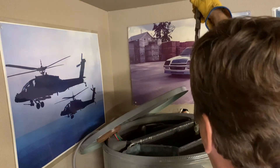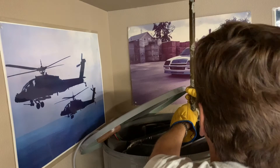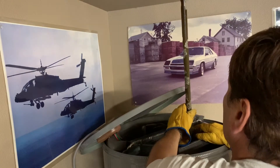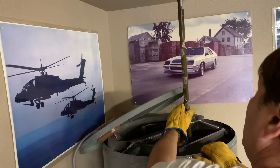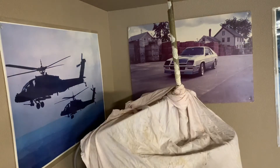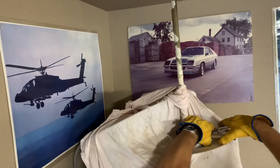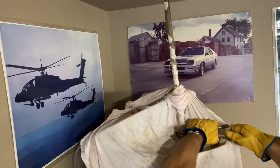There we go — and here it is. You can see the corrosion; this is saving your hot water heater's inside, sacrificing itself in its place. As you can see I'm hitting the ceiling, so I'm probably going to have to get a hacksaw and cut it. I don't want to lose the bottom of it into the water, so I'm going to put some vice grips on it to grab it so when I cut the top off it stays.